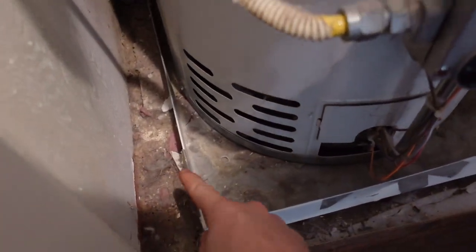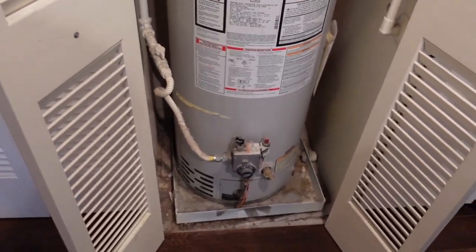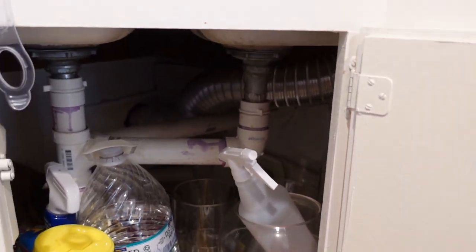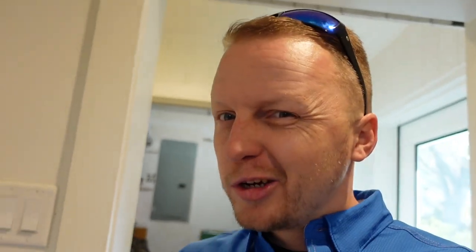The next thing to report on: you start to see some heavy dryer lint. Dryer lint is really flammable and this is a gas water heater, so you want to report that the dryer might not be connected properly. The dryer is all the way over here — checking behind it, you've got a heavy bend there, and then it comes up and through the cabinet. That's a weird way to travel. They probably have some sort of lint leak getting close to the gas water heater. They just need to seal it up better and add a rigid pipe to allow lint to travel out more easily.